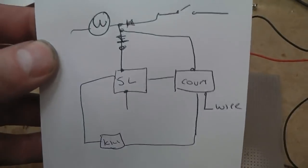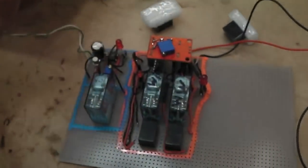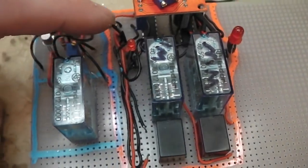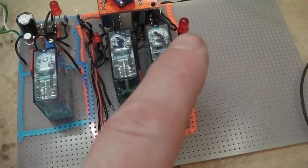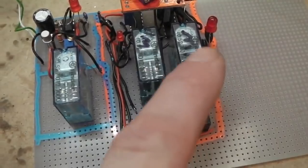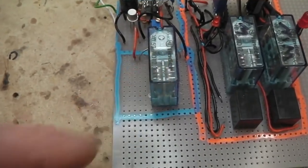I've kind of like sketched it out. These diagrams here were to help me plan out some of the outputs when doing the programming. These wires down the side of the programming links to give me the time and duration and interval of these. There's a washer and a wiper relay there that does both. There's a wipe only, that's post wipe in the automatic system, and then a wipe only for intermittent.